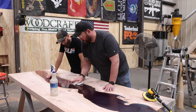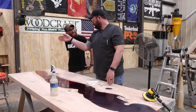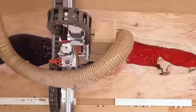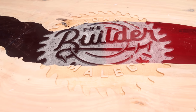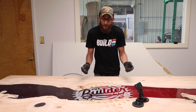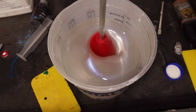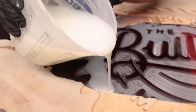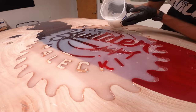Now we got to figure out how to keep this table alive. The polished turd itself just needs something to break up this line in the center. My thought here: a 22-inch white Milwaukee logo in the center - then we have red, white, and blue, which we love, and I think it might help save this thing. Jordan got the logo all cut out with the CNC - this thing's looking pretty cool. We're going with the red, white, and blue theme to try to hide the fact that this is sort of a weird didn't-mix-together thing. The difference between an amateur and a pro is just hiding your mistakes. I've got the white diamond effect pigment from Black Diamond Pigments. I'm going to go with Total Boat High Performance Epoxy - it's only about a quarter inch deep, going with the medium speed hardener. About a liter to a liter and a half of it - mix that up, add some white, and we'll get to pouring.